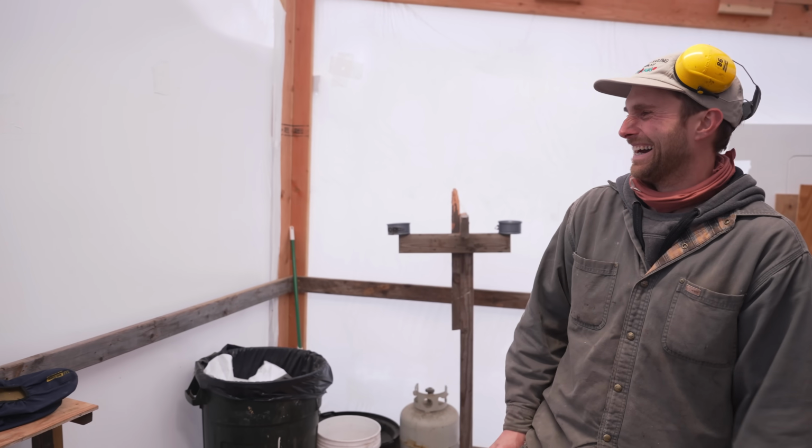If anyone's wondering why all of our bronze hardware on deck is starting to look a little tarnished, it's because we've been pickling the deck twice a week. We've been scrubbing it down with salt water. First of all, to discourage any presence of fresh water on deck, and also, sorry, what was the other reason? To make sure that the deck planks are taking up and the seams are staying tight. And all this blazing sunlight we're getting. And all this crazy winter sunlight.